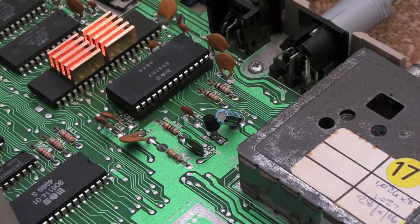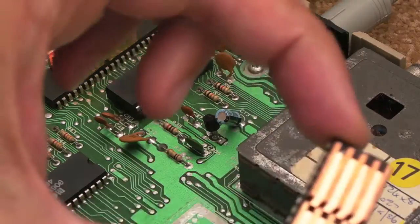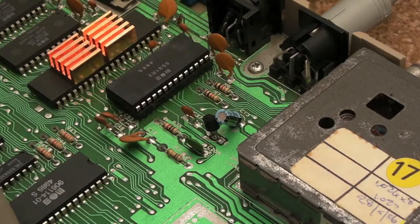I don't know how well that came out. When I said three tests, it was basically three iterations — one for each of the channels — of various types of sound with sweeping effects and filtering and all sorts of things. But what I do know is I've just tried this with the spare chip I've got, and it sounds a little bit different. So I'll try to play the two back to back so you can compare. What I'm going to do now is swap it out for another 6581. I'll just take this heatsink off here to get the manufactured date and stuff off it.